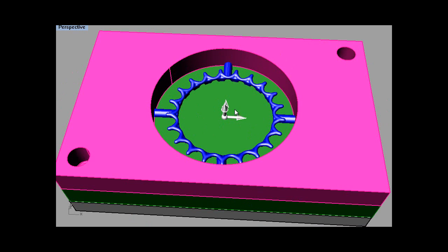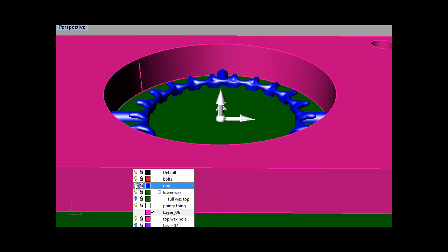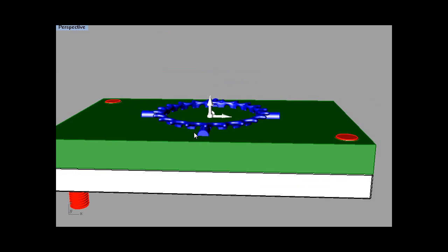Now this circle is your boundary that you let it have in the tool pathing program, and what I always try and do is, if you're roughing with an 1/8 milling bit, then always draw an 1/8 circle here and make sure you've got an 1/8 gap on the biggest part, so it can always get round it to clean it out. And it will cut down, say it's cut to exactly halfway there, so you'll be left with that if you take that away. So that's what you'll be left with in the wax.